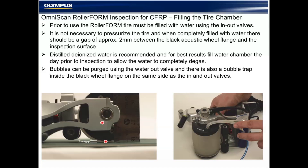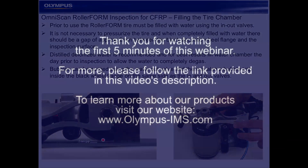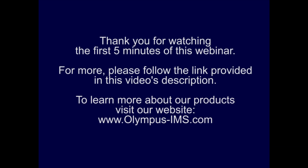The bubbles are apparent through the tire material, and there's a bubble trap on the left side wheel flange. A slight shaking of the tire with the wheel flange in the highest position allows the air to exit. The tire need not be pressurized, just filled completely. A good fill is apparent when we have approximately a two-millimeter gap between the plastic wheel flange and the component, and if we rock the wheel probe slightly, we can see that edge tapping. Too much water distorts the tire material and requires extra unnecessary pressure.